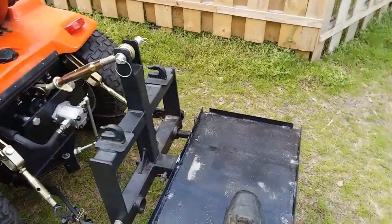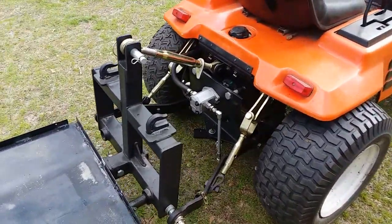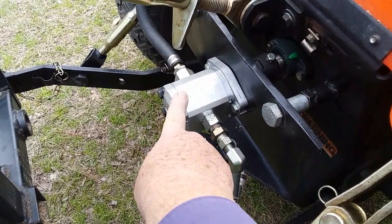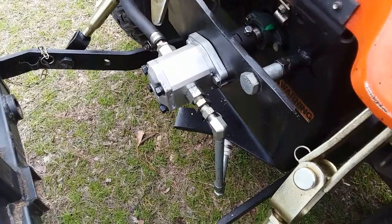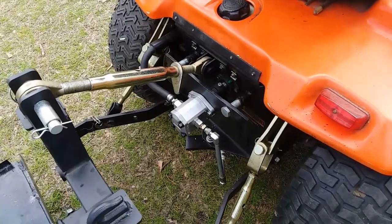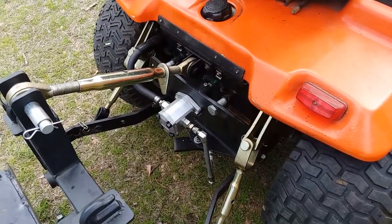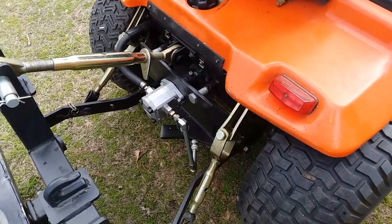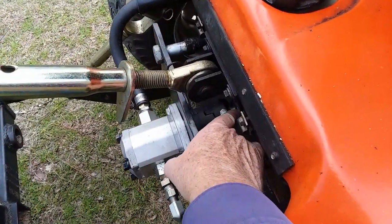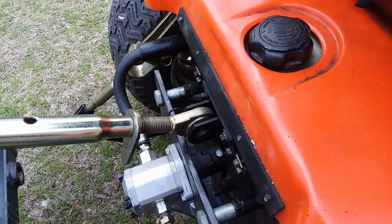This platform here is for ballast weights, and you'll see that in the performance test. Here you can see the hydraulic pump. This is a counterclockwise pump — a six-gallon-per-minute pump, and it's very nice for this size tractor. If you're working on something bigger and wanted more hydraulic capacity, a bigger pump would be appropriate. But this is really the appropriate size pump for this tractor; it does a very nice job.